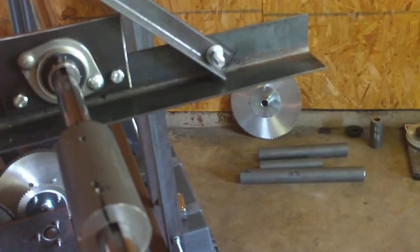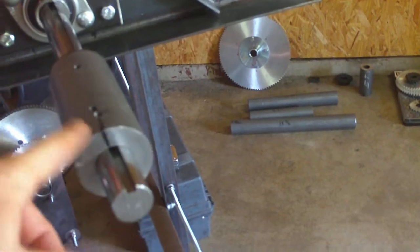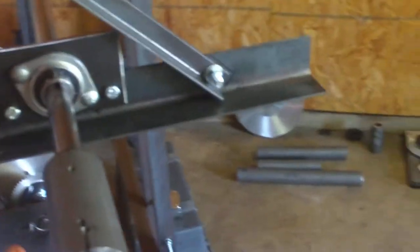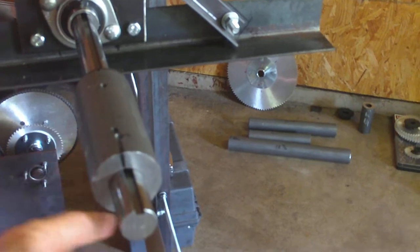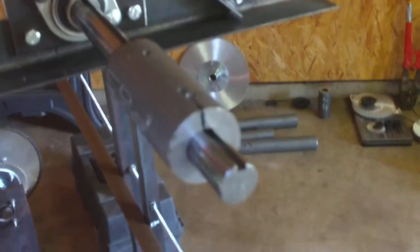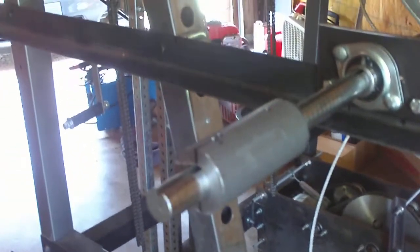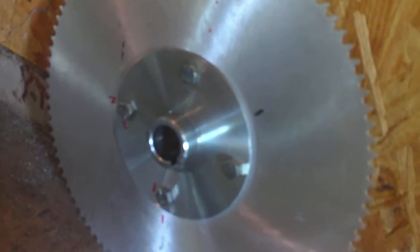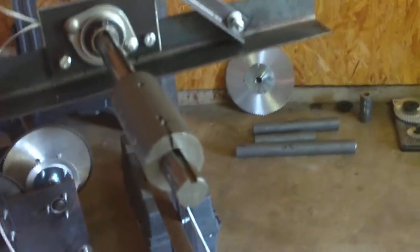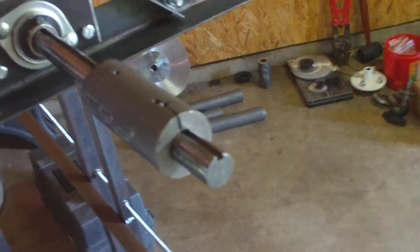Through deflection mathematics I decided to give this a shot. What I'm attempting to do is basically increase the overall diameter of this one-inch piece of material by simply sliding this DOM tube over it. You might ask why not just get a bigger shaft — well, a two-inch diameter shaft is very expensive, we're talking hundreds of dollars. And it's also very difficult to find sprocket holders that accommodate two inches; they do make them but they're also very expensive. As soon as you get above one inch in the sprocket world, things get very expensive really fast.